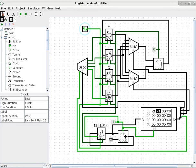Send data on a specific output, like to a monitor or a keyboard. Saving data? Okay, that's a great idea. Because at this point, everything in this picture is a part of the processor. Where's RAM? RAM is external to this. So we need some kind of circuitry to interface with RAM as well. In other words, we need some mechanism to say, I want to access the content of that location in RAM, or I want to store the value of this register into that RAM location. Or the other way around, I want to read that RAM location and then store that value into this register. We don't have those mechanisms yet, but you can see how we can expand this structure to also interface with RAM.